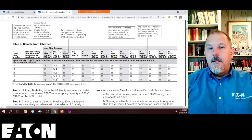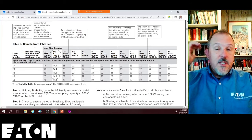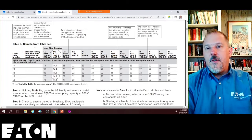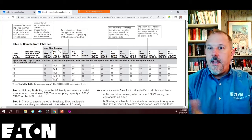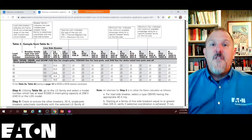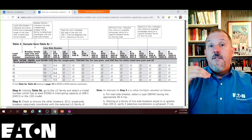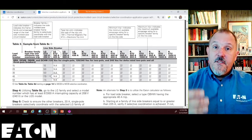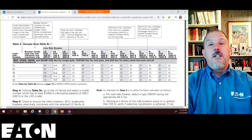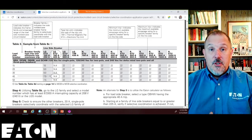So I said, in a 517 system, you're ignoring fault current. Well, what's the most common? And they'll say, well, three-phase bolted faults won't occur. The arcing ground faults will occur, which your arcing currents will occur. I said, okay, arcing ground faults are somewhere around 60, 70% or whatever that is. Let's just say 50% for giggles, right? 50% for round numbers, of 4,000 amps bolted fault current. 50% is the most common fault current that you'll see in this power distribution application. He said, absolutely.